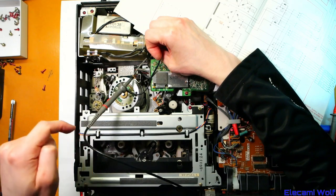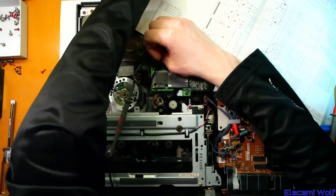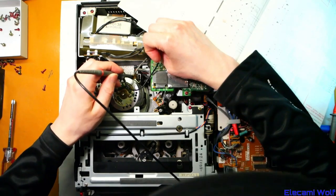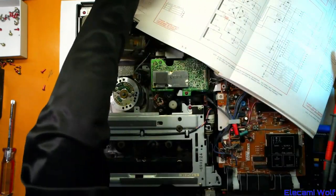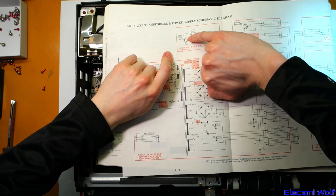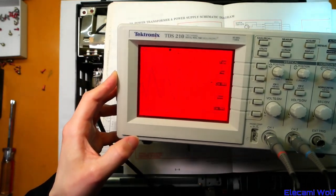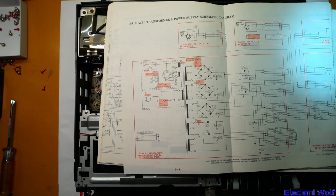I think I've worked out what's going on here. The voltage going into the regulator has got major ripple on it, and that is a problem — that means the caps on that board are done, no longer functioning. We're measuring between there, which should be 9.6V, but it shows as around 10 to 12V. When you look on the scope, you get a triangle wave shape, which is not what you want. That's AC-coupled, 200 millivolts per division — going up and down by about a volt. Not really what you want on a power supply supposed to be 9.6V.